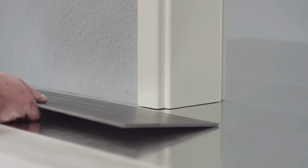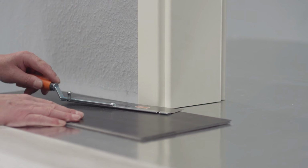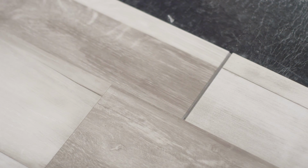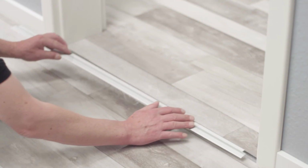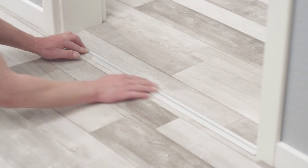Where necessary, simply shorten the door frames too. To achieve the right height, simply use a leftover piece as an underlay and a sharp saw. You can't lift the plank as usual here. Push it in quite simply via the long side. An expansion joint is necessary in door transitions too. For covering purposes, fit appropriate profiles.